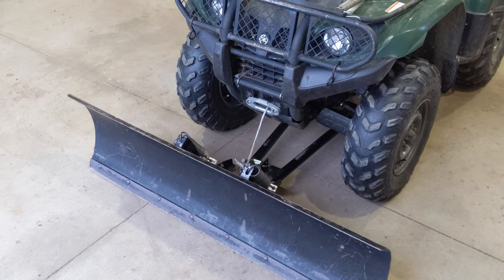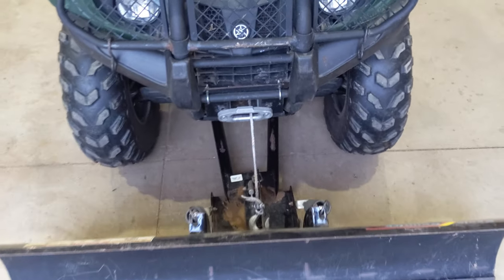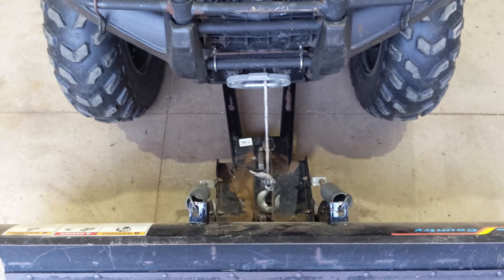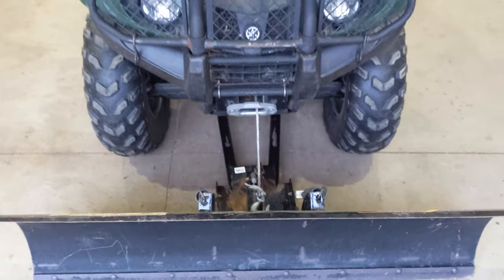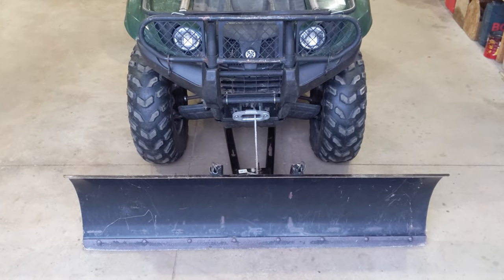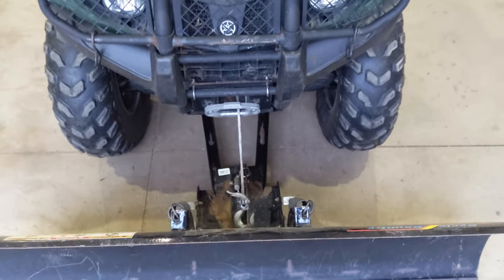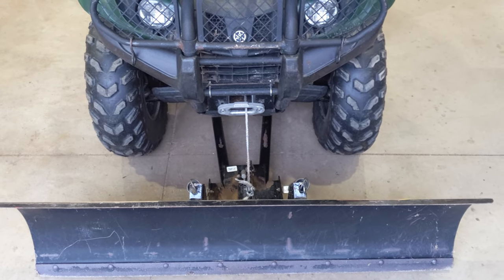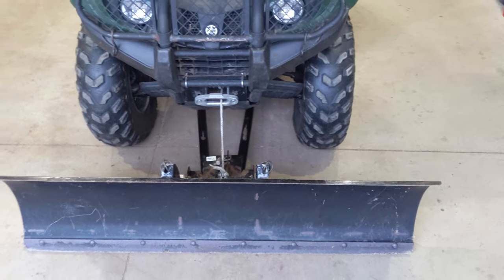cable. And after you repetitively raise it a little bit too far, it strains wherever you've got a knot in this rope, or a bolt or a clamp on the cable. And eventually it's just gonna tear or rip off. And I think every third time I plow snow, I have to retie this rope, which is a lot easier than dealing with the cable. It initially came with a cable, and dealing with the clamps and stuff when it's cold and dark and it's buried in snow, that's not fun at all. The rope's been a lot better.